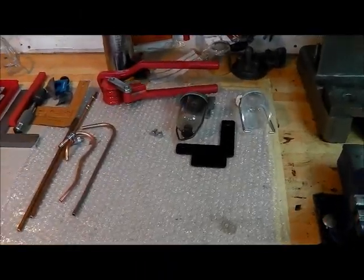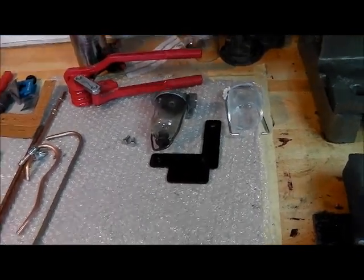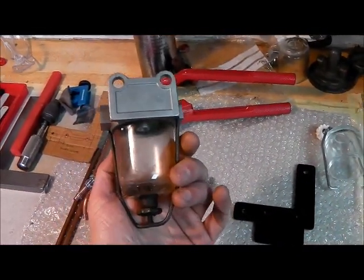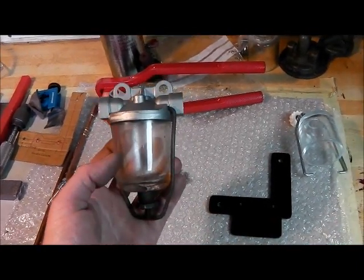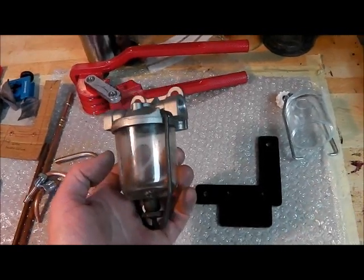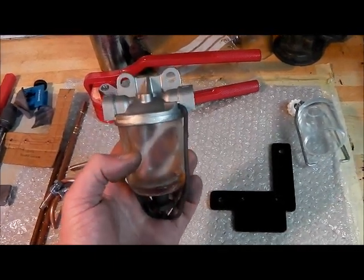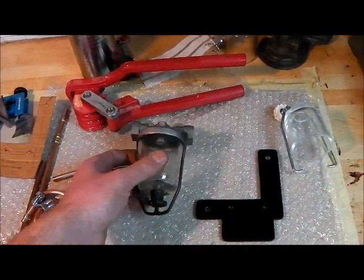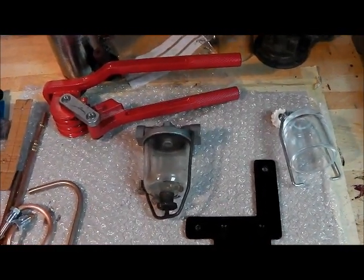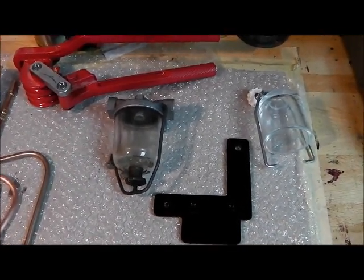My car has the plastic element filter that I rather dislike. One type of filter I do like is the old AC Delco type with the glass bowl — they're quite good for being able to see what's going on in the fuel system. If it's full or half empty, it's a good indicator, and they're quite good at separating out dirt. You can get a little element that goes inside, or you can rely on the gauze in the top. I'm quite happy with the gauze.